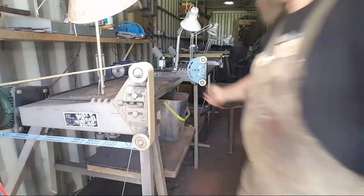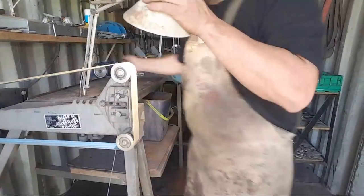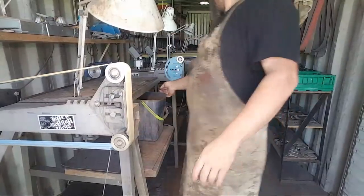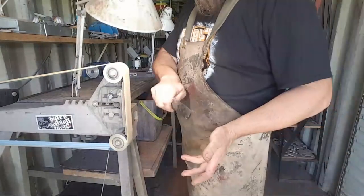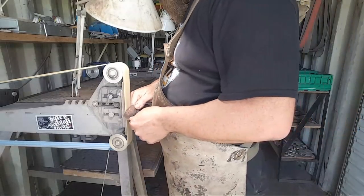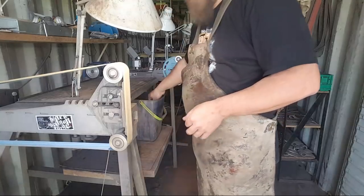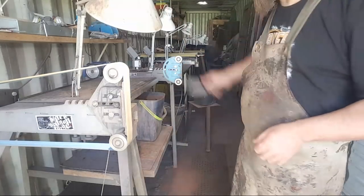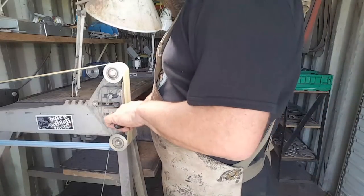Okay, so switch on the machine. It's already slow. So set the tempo again. Okay, faster than that. Stay in stance. Remember to talk about stance. Everything is still the same. I am just going to break that edge. Okay. Cool down after every single wipe. Get rid of the excess water on your blade, and now I'm going to do the other side.